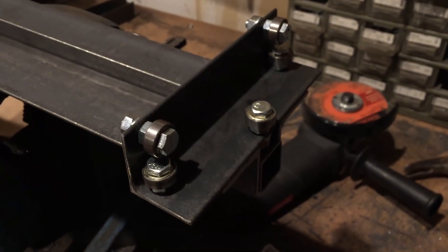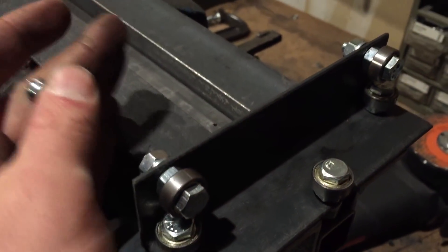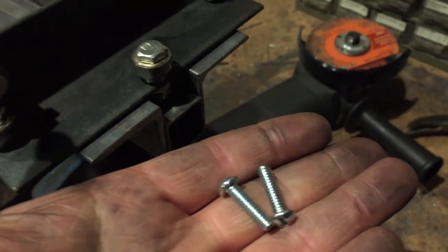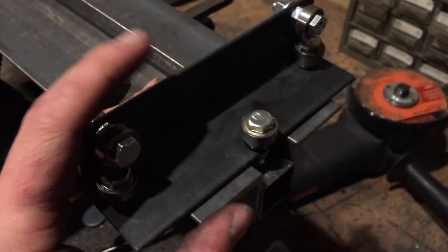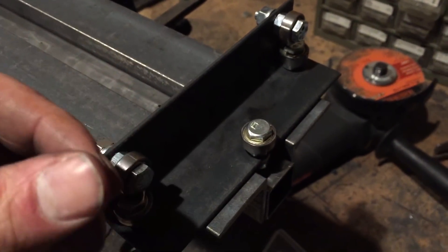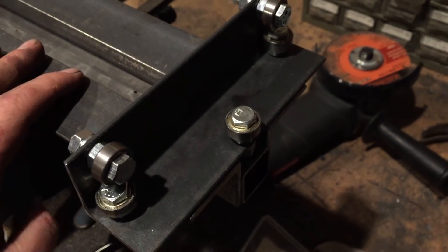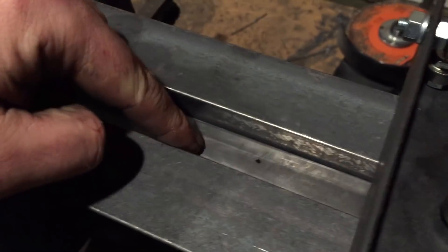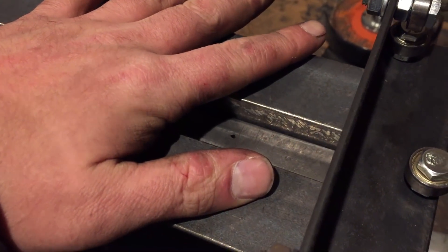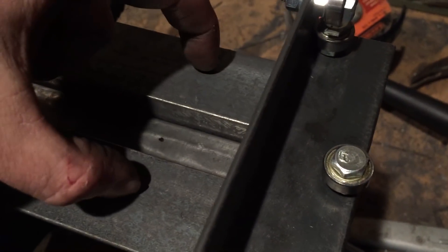We're at a stage where things go a different path. For the gantry risers, I'm not going to countersink and tap — instead I'm going to use regular pan head or truss head screws and through-bolt with nuts. The reason is if I ever want to change the alignment of the carriage relative to the gantry riser, I can just loosen the screws, make adjustments, and tighten back down. I have two risers and a piece of one-inch square stock as a spacer, just so the hole positions are accurate for later assembly.